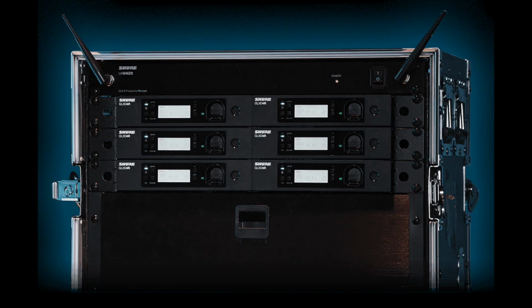But the downside of this system, like I said, is that it uses a SHURE proprietary battery. Sure, you can probably replace it with AA alkaline batteries, but most of the people using wireless microphones are almost always using rechargeable batteries. Yes, it's not recommended because rechargeable batteries are roughly 1.2, 1.25 volts versus a standard alkaline, which is 1.5 volts. But a lot of people do it anyway, and if you just have like 5 events a day or 10 events a week, then buying alkaline batteries all the time is just ridiculous. So a lot of people use rechargeable batteries, and it usually works fine.